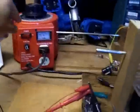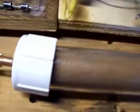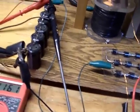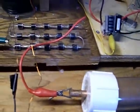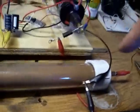I don't know if you can hear that clicking — that's the spark inside there, kind of hard to see. But what I'm going to do is: I'm turning on the power and I'm charging this cap bank up and it's sitting at 1,160 volts. And if I trigger this, you can see that spark — it doesn't matter if it's 4 volts or over a thousand volts, that high voltage is still finding ground by jumping the gap, directly slamming into a thousand volts sitting there. So it doesn't matter if it's a positive, it's a lower potential positive, coupled or connected by a common ground right there — so the high voltage can go back to ground.